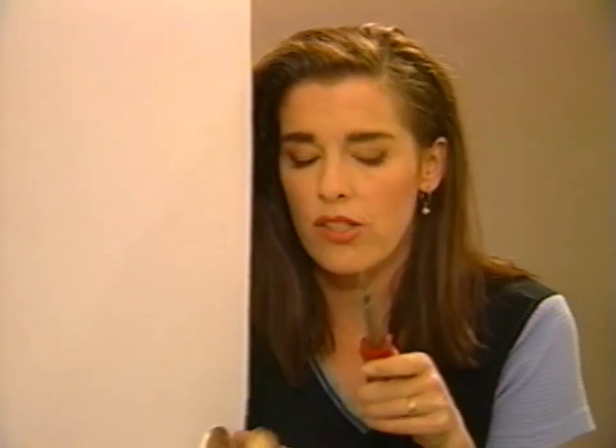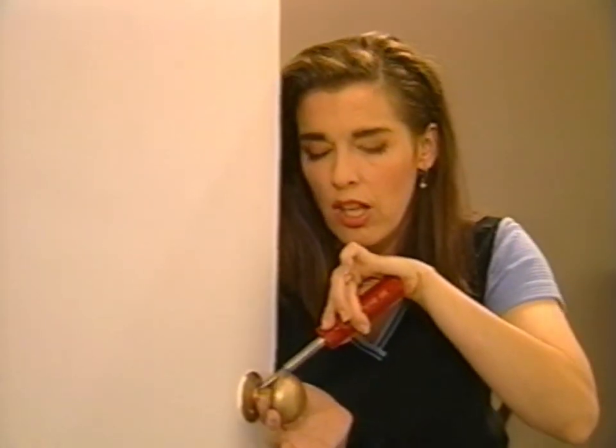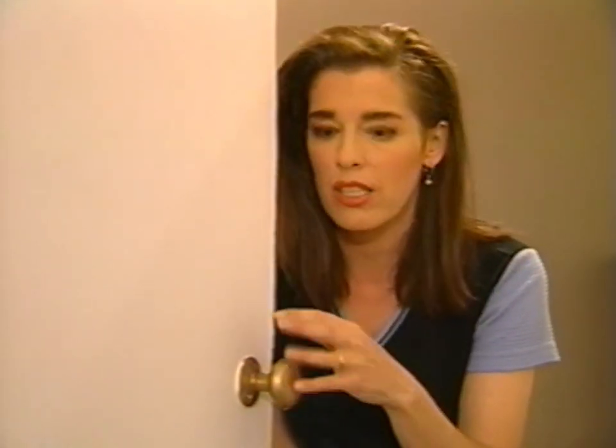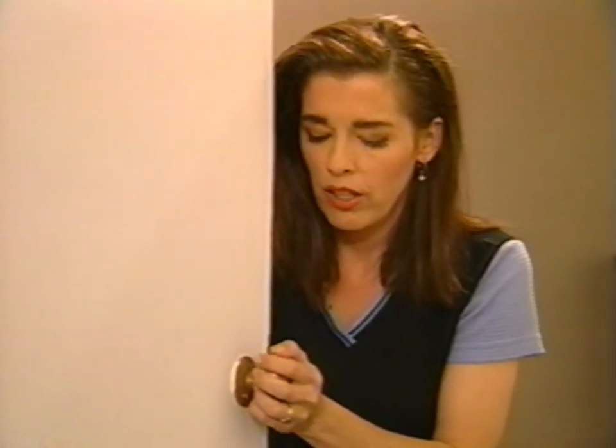Sometimes they're really small and hard to find. Another kind of door handle is one which has a spring release — you have to take a slot head screwdriver and reach into the little slot which trips the release, and then you can pull the door handle back off the spindle. However, that kind of door handle doesn't actually screw onto the spindle — it's push-mounted, so to tighten it you just push it in on the spindle.